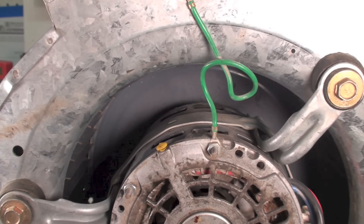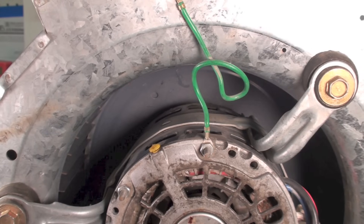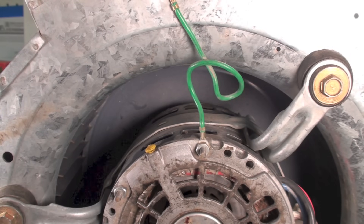Don't count on it. The bearings are damaged because these are bushings and it's going to fail — no two ways about it. You'll be back again if you just oil it up, and the customer is going to want you to pay for it the second time around. So if you have stiff bearings and you just need to get them going because you don't have a motor, you can try oiling them. Sometimes you'll get away with it, sometimes it'll work okay, and you'll get them moving again. But there's too much clearance in the bearings now, or they've scored the shaft — something like that. The thing's toast.